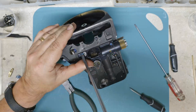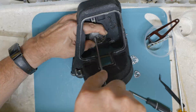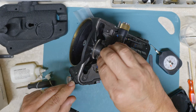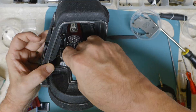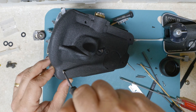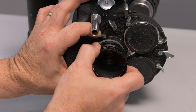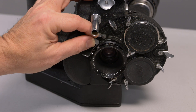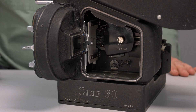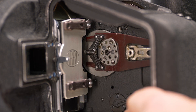The unit is amazingly simple and robust. Everything is gear-driven — virtually no springs and no belts. Except for a couple of measurement instruments, nothing is required for servicing other than basic tools. It is, however, a precision instrument. I've tried to choose parts that have the least amount of wear and play, and I'd have to do a film test to check the stability of the image. Many of the important tolerances were built in by the factory, like back-focus distance for the lens and exact frame-line positioning. The only maintenance required of the user is a bit of grease and oil every couple of thousand feet. I think most of these parts came from the same camera, so I might get lucky.